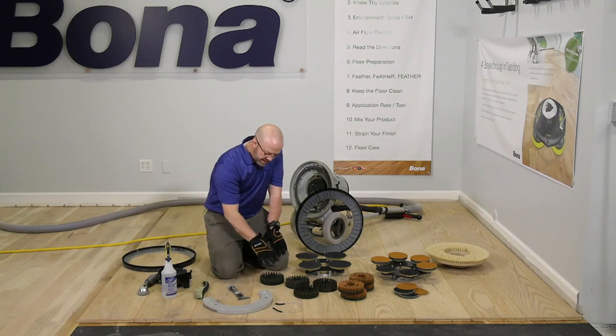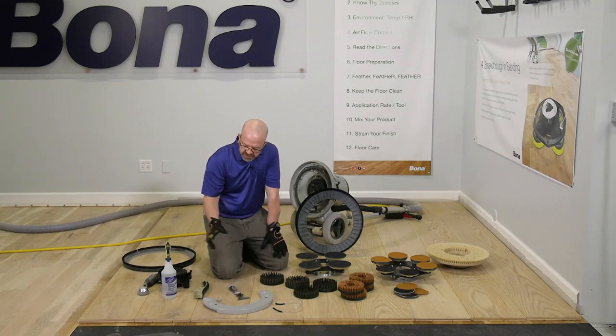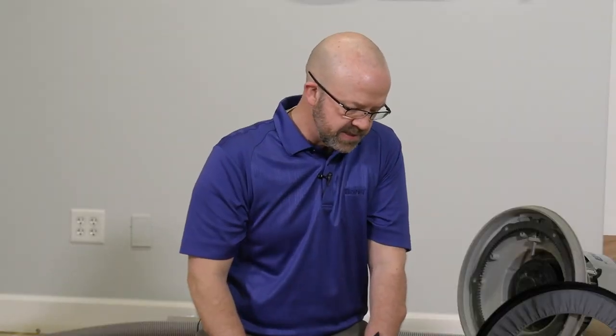So water pop it first, let it dry, but we're still going to spray water on it while we're going. One, it helps re-soften and makes it easier to pull that grain out. Plus, again, it helps the wires in your brushes run a lot cooler, all right? So you'll see Bobby spraying with water as we're going to help in both those processes.